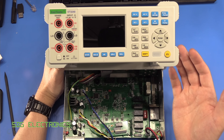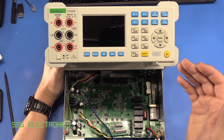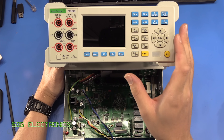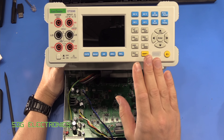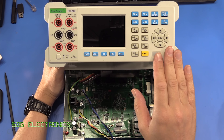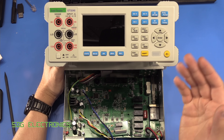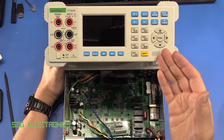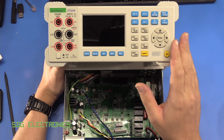So that's a look at these two benchtop multimeters. The four and a half digit meter I think is really quite a compelling purchase at a reasonable price point — the performance is really good. Even without that extra digit, I've not seen really any difference in accuracy between the two. It's been running for a couple of months and still gives bang-on readings. I've been really quite impressed. The user manual gives a really detailed guide on how to calibrate it if you have access to decent calibration equipment, so you're not just stuck with a device that's been calibrated once.